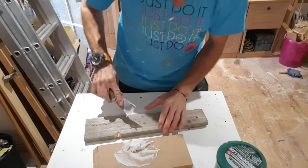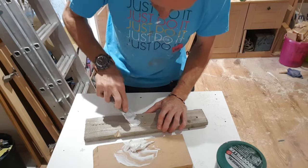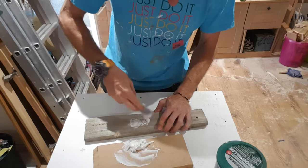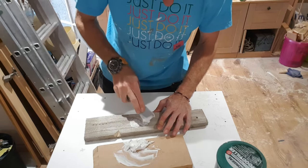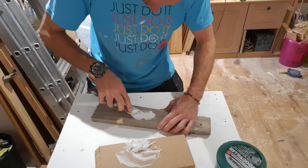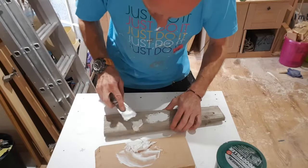I'm happy that it's mixed up and ready. Let's start off by getting these holes filled in — they're quite deep so I need to make sure I get the filler right inside the hole. Before we try and put a screw or nail in, I might give it a quick sand, so I'll leave the filler protruding the hole slightly — that's probably going to be a good thing and will let us see what it's like to sand.